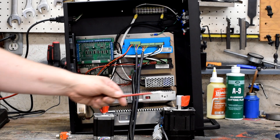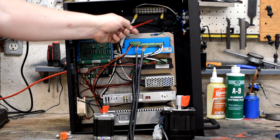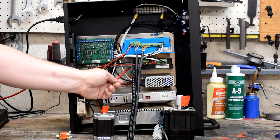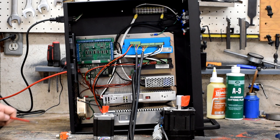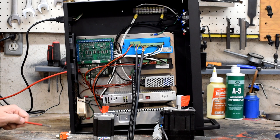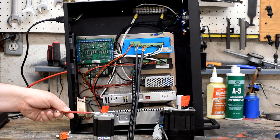That's really all there is to it — this is not rocket science, it's just Lego. These things need DC voltage, so you need an AC-DC power supply to convert. This needs 5 volts, so you need a 5 volt supply. You need a distribution block and circuit breakers — very straightforward industry Lego stuff. One difference from the prototype is we've added a different kind of motor driver. This simple current chopper takes a pulse and direction and basically acts as a big relay to run the stepper motor. The issue is the controller has no idea whether the pulse it commanded ever actually got there — it commands 12 steps counterclockwise and just trusts that it happens.